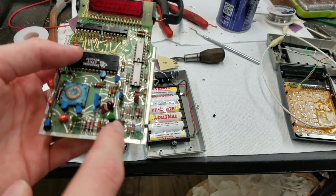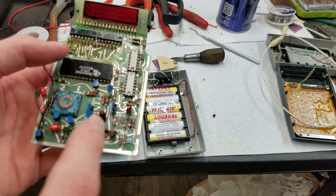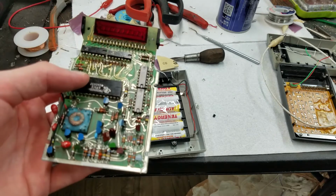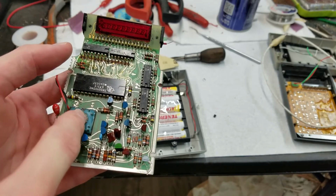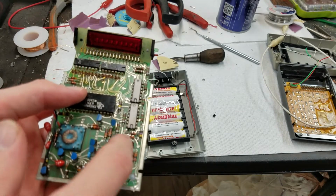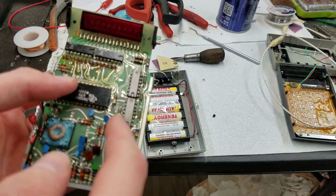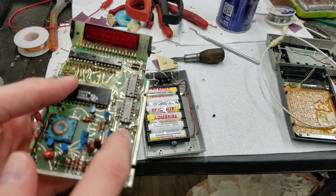But basically, this circuitry listens for digit 11 and digit 5. So when the display times out, when it sees digit 5 and it's in display timeout mode, it directly drives that dash segment. Digit 11 is for the L. So if it detects a low battery and it sees digit 11, it will light up the correct segments for the L. That's what these diodes here are for. One of them I've stolen as parts for the other one, but there were 3 diodes here. Those connect directly to the anodes for the 3 segments to make the L. Those are activated by this pair of transistors here.